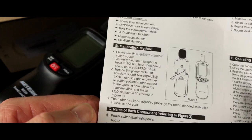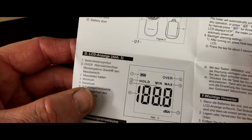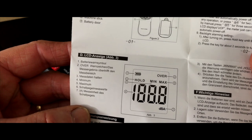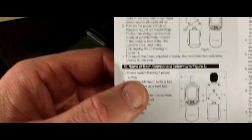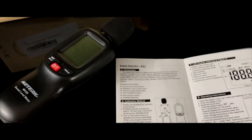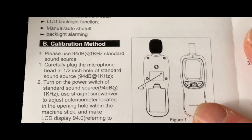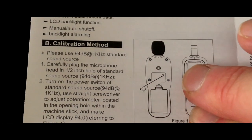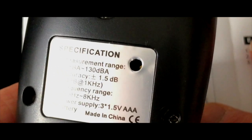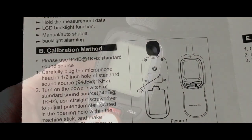That's interesting — I have to calibrate it. My NIOSH app has been tested with an official sound meter and was surprisingly accurate, so I used the screwdriver as suggested to adjust it to match the reading on the NIOSH app on my iPhone. The other way of calibrating is to use a device that outputs exactly 94 decibels and measure against that.